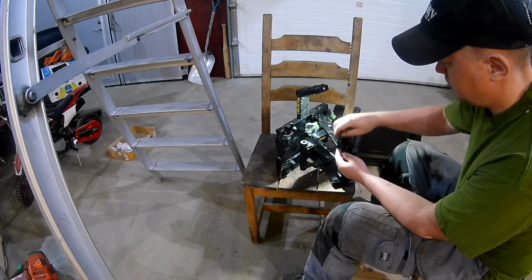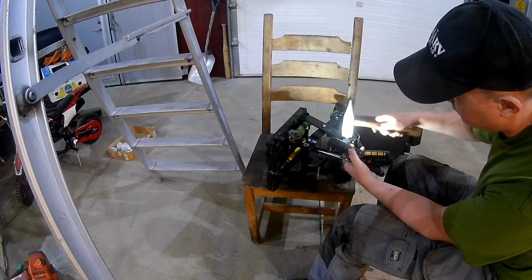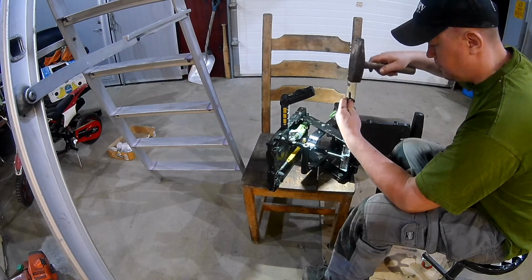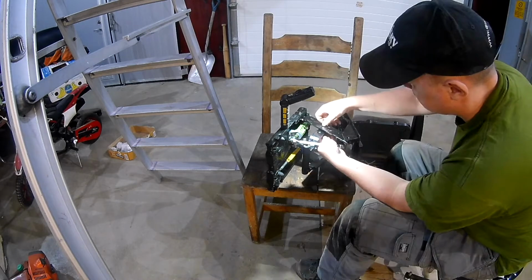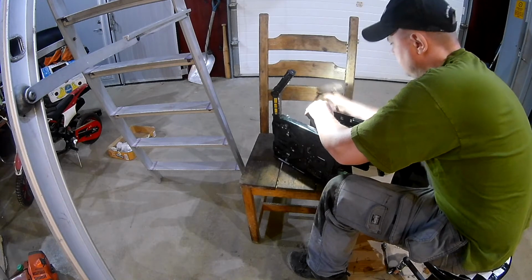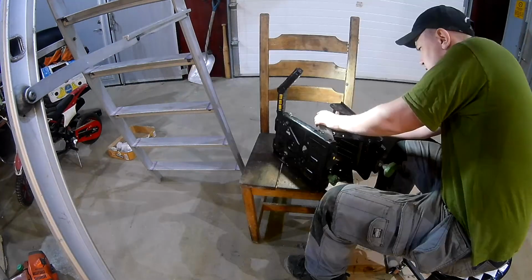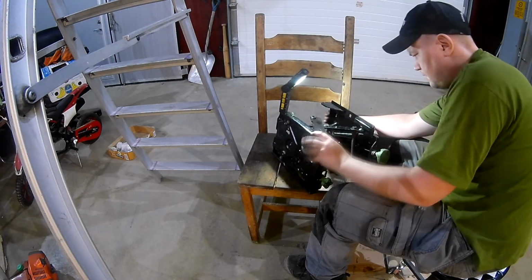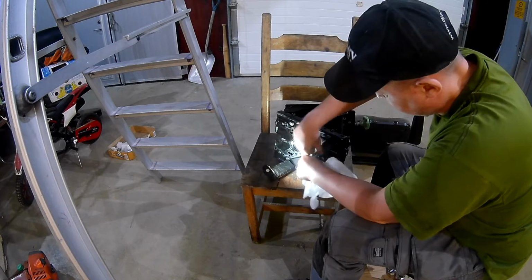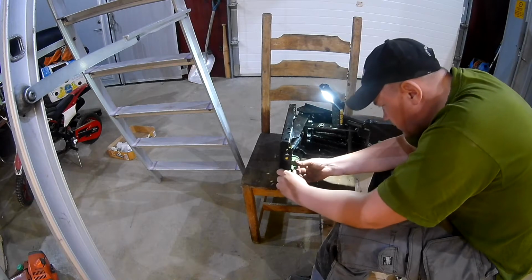I found one that was actually really broken, and it was metal on metal contact, and that was probably the real issue with the squeaking. Some of the pins here needed a little tapping to get out. There are actually 6 of these plastic bushings here: 4 in the top and the bottom in the back, and then 2 in the middle in the scissor lift arrangement. The parts diagram only shows 4 of them, but you need 6 if you want to replace all of them.